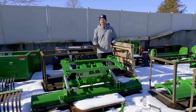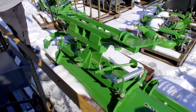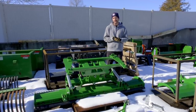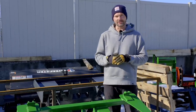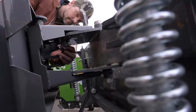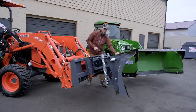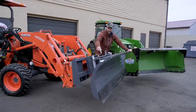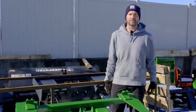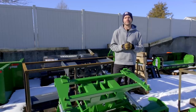What you have right here is a loader-mounted snow plow. Most of these come to me as a manual setup, and for good reason — 90% of tractors don't have additional hydraulics. But you can add a hydraulic kit to make it hydraulically angle instead of getting off the tractor seat, pulling some pins, and manually rotating the angle. That takes a lot more time and gets cumbersome, especially when it's cold and dark. So that's yet another reason to think about getting a third function for your tractor.